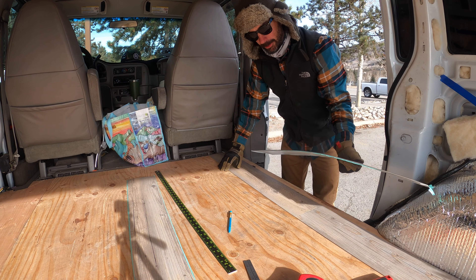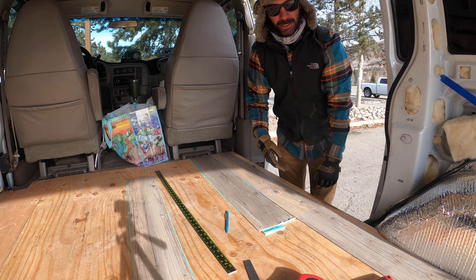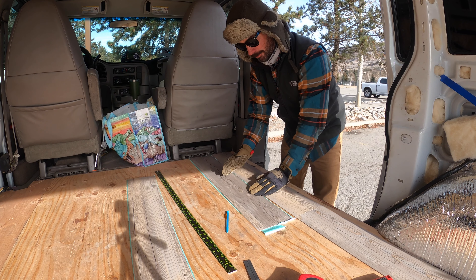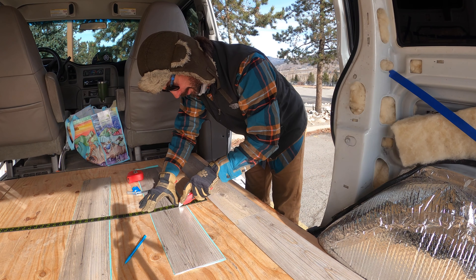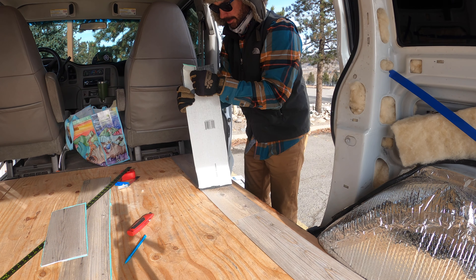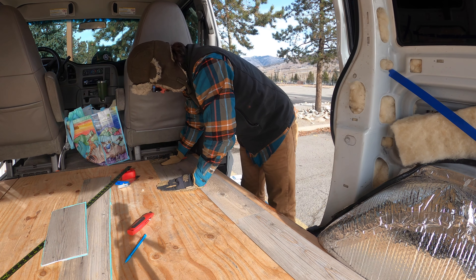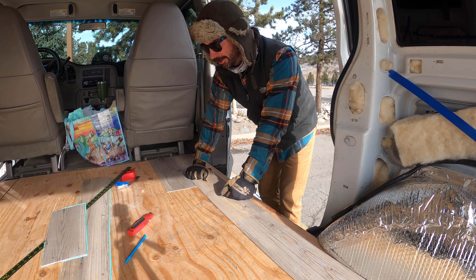We're down here ready to start the second row. Now, you're going to have to make a cut. The reason why I say that is, if I just laid that down again and did it all the way, you'd have the same lines — it just wouldn't look aesthetically pleasing. So you want to measure, say wherever you want, make a cut, lay it down, and then you can start laying down your full planks again. Make sure you press it right up to the first row, nice and tight. And that's pretty much the process — let's keep it moving.